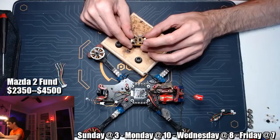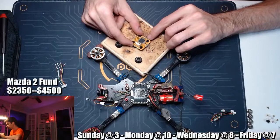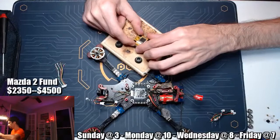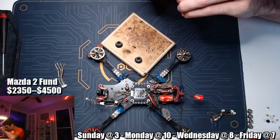So I just need to look at what these bottom pads are. Three pads over is the VTX, so I am going to use that. And then the only other thing that I need is a TX pad, a transmit pad. And it looks like there's one of those right next door. It looks like there's T... I can't even see it. TX4, maybe. Silk screening's kind of tough.